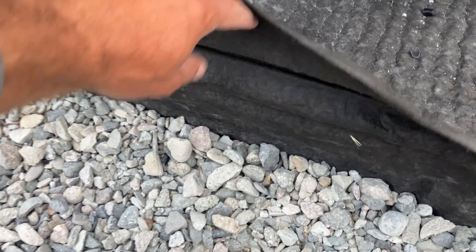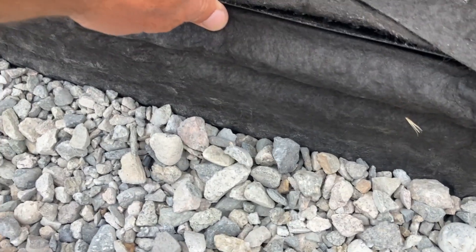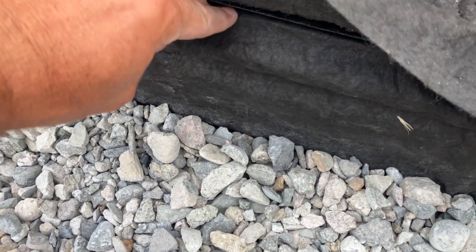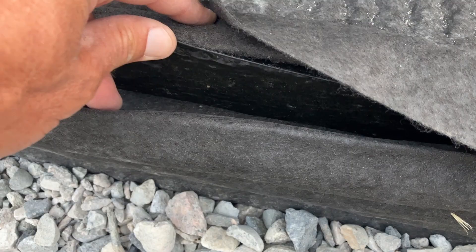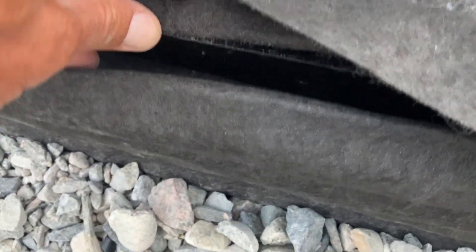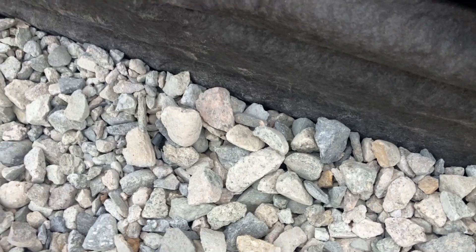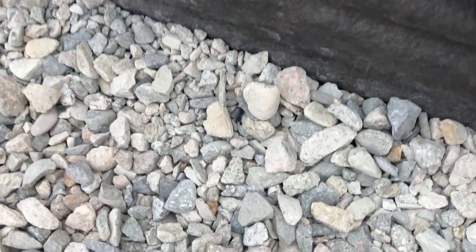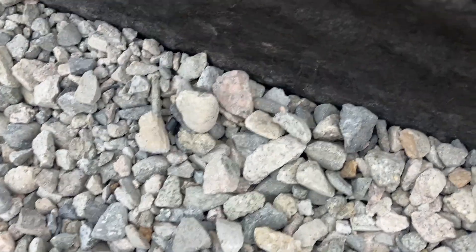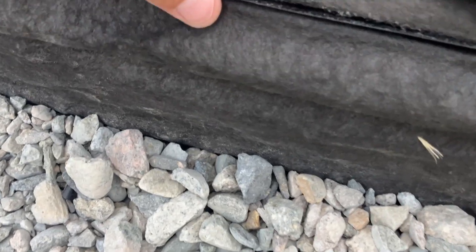Here at the vertical piece of the footing, we put another piece of six-inch SWD drain down on the vertical. You can see the waterproofing goes down about three to four inches on the vertical part. This is replacing a four-inch perf pipe like a regular French drain — we just backfill with good clean rock and it already has a filter fabric built into it.